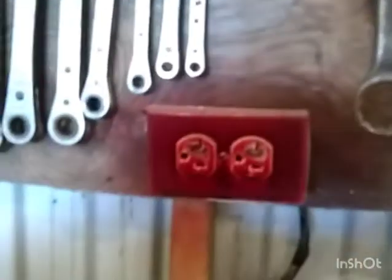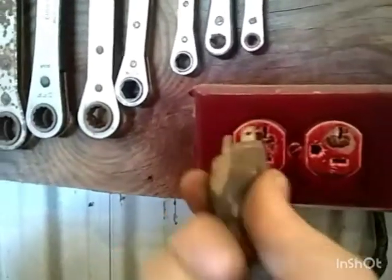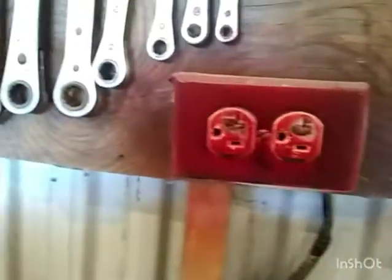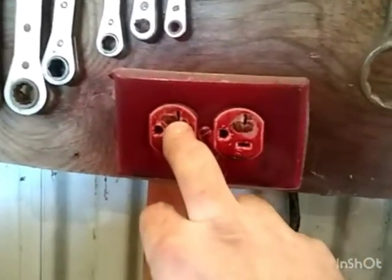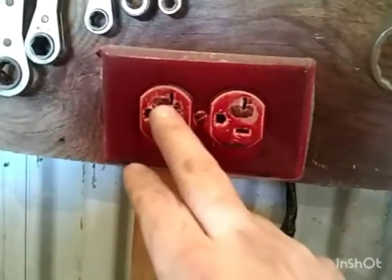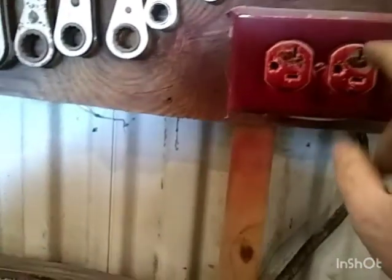I also got a little spot welder down there. I use it on the outlet right here — it's the one in red. It basically looks exactly like a 110, but I've actually filled up the hole so you can't plug a 110 into it anymore, so somebody who's not used to my shop can't just come and stick a 110 in there. I just went in with some epoxy, filled in those slots and opened up the one slot again. It's never got hot on me, never started melting anything. I've got my actual 220 line coming up into this box.